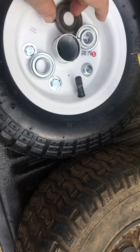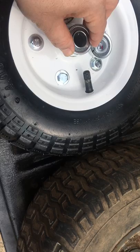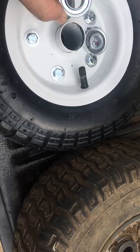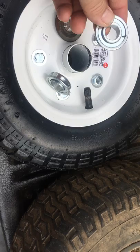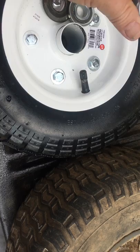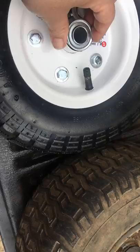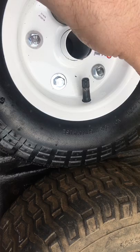I was going to grind it down, put a bushing in, but finally I popped them out and went to the hardware store - lo and behold they sell the bearing in the right size. This is three-quarter inch. The shaft measures a little over 5/8, but it's actually three-quarter because that's the size lawnmowers and yard carts use. The half inch or five-eighths is basically for dollies and smaller applications.